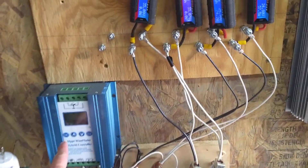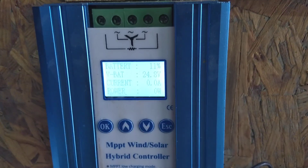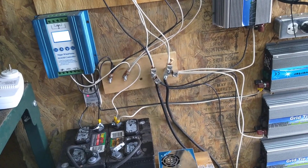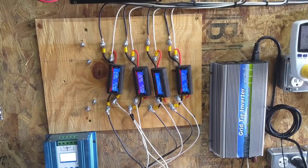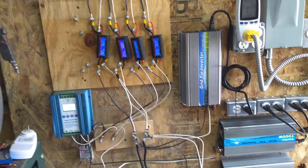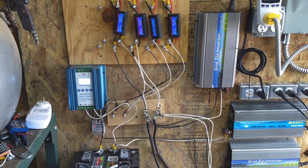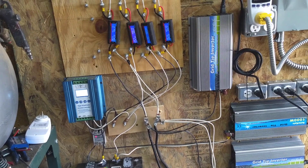I'm kind of happy with the setup and I wish I had tried it before. I'm probably going to go ahead and set up the other charge controller so I can have the Healey running on it. It still reads 24.8, and I'm going to convert that to 48 volts. I think especially with the Healey still being hard to start, the 36 volt configuration is just too much drag on it. So the next step is to do the same thing — the same solid state relay — with the 48 volt controller, which can also handle a 48 volt setup.